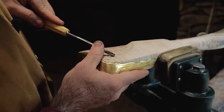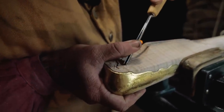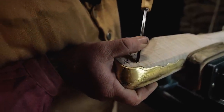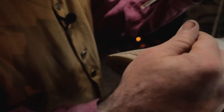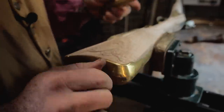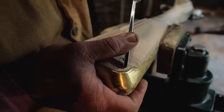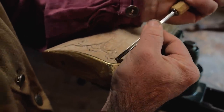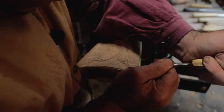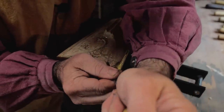Apply pretty good pressure but don't overdo it, because especially when the grain changes your chisel can slip and you'll put a big gash in your stock. That's why I do a wiggling motion — I can see the wood coming out much better. If you just slice in one motion instead of wiggling, it's actually easier for your chisel to slip. And if your v-chisel starts binding on you, it's either because you're going against the grain, your chisel is dull, or you're applying too much pressure.